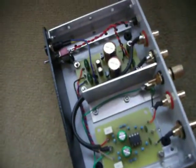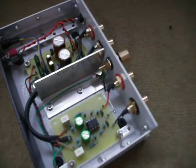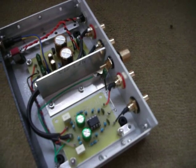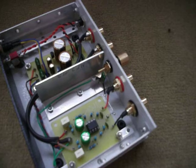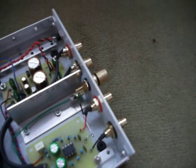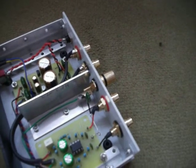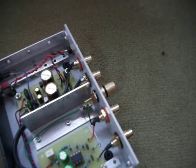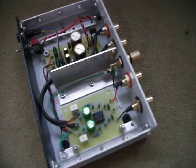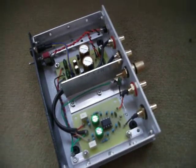I've used lots of snubbing caps everywhere so we won't get any RF connected through to the ground or shield of the wires coming out of the turntable from the cartridge — a 10 nanofarad capacitor — so that will get rid of any RF coming into the amplifier, which is quite important, as opposed to letting it run through the ground bus to the output which could have caused excessive RF on the output.